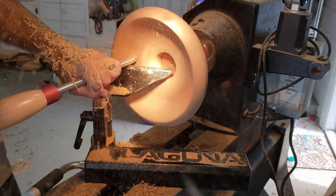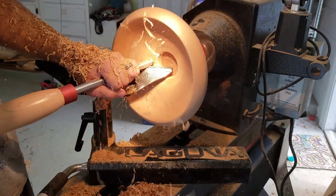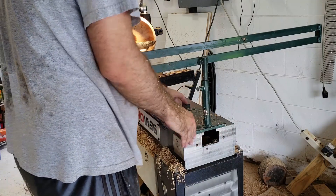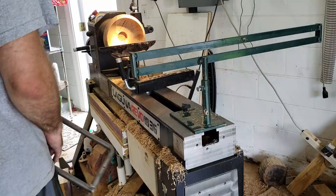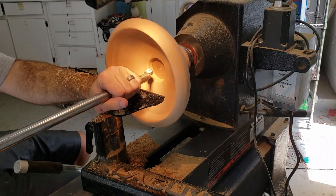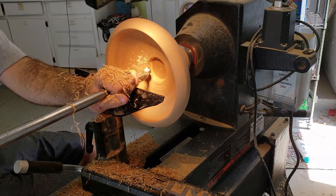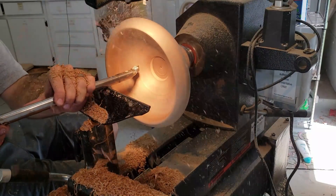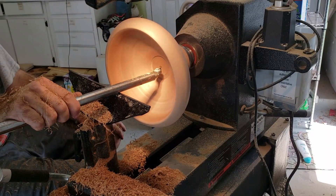I like to use carbide tools when I'm hollowing out things — it's easier to get the angle just right, not to mention this oak bowl is really tough. For the last bit of the bowl, I switched to my Jameson hollowing rig, because the tool at the very back of the bowl is pretty far away from my tool rest and I don't have a curved tool rest. Not to mention it's almost impossible to put a catch with the Jameson tool. Another nice thing about it is it comes with a laser sight, which will help you determine how far in the bowl you are and where the wall thickness is. Honestly, if I hadn't been using this tool when I was, I probably would have gotten hurt pretty badly, as you'll see next.